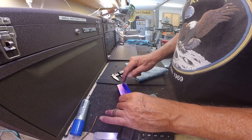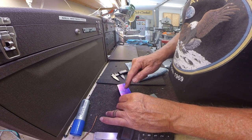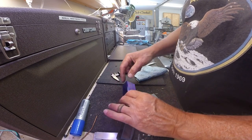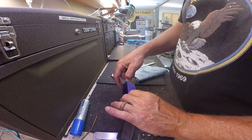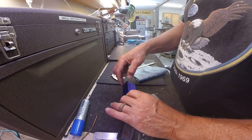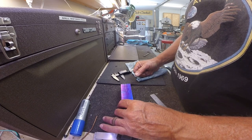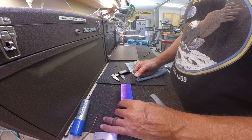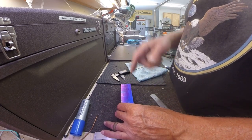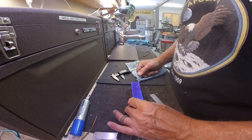And after we drill the hole, we'll split this and split it this way, and then we'll cut this off so that we can drill 2 through holes and drill them here, clearance holes, and then tap into the bottom. And so we can use a couple cap screws to clamp these 2 halves back together. We probably don't even need this. We could probably cut this the full length and then cut that off, but we'll see what we decide to do for that. Okay.